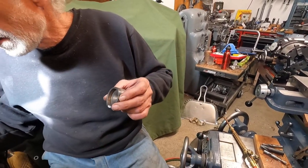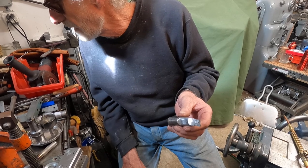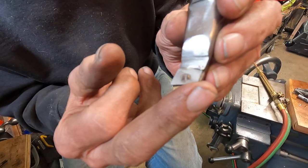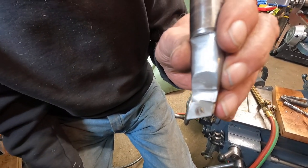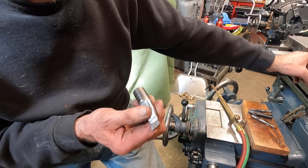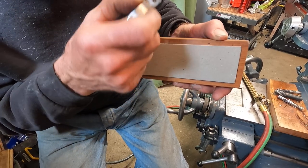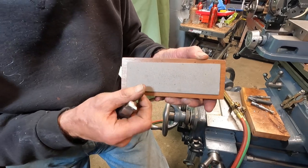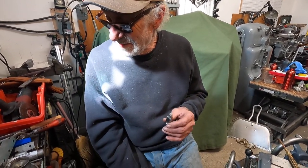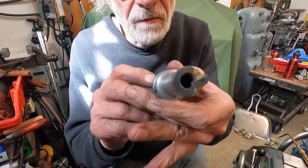Now I'm going to get another tool over here. This one here — I had the most beautiful one, but I set it down and I can't find it. But this is basically a boring bar type tool. I wanted to show this because I just used a used carbide insert. You don't have to go out and buy carbide blanks. You can take a used insert and start grinding on it with a green wheel and get something like an easy lap here, and start making your own tools real easy. You don't have to have the cutter grinder and all that stuff to get started. If I dug through my stuff, I'd probably find some tools I made long before I had the cutter grinder, and they're even uglier than some of my ugliest tools. Like here — this is an ugly tool here. That's pretty ugly. But it's a real effective little boring bar.